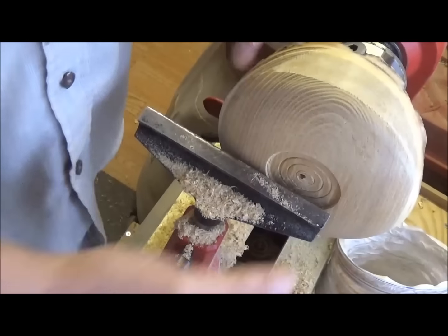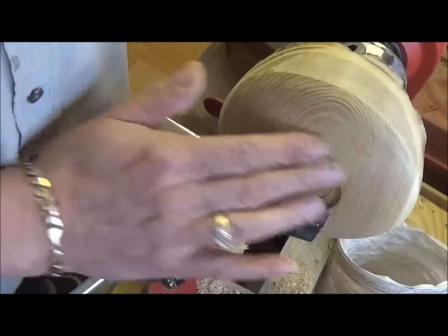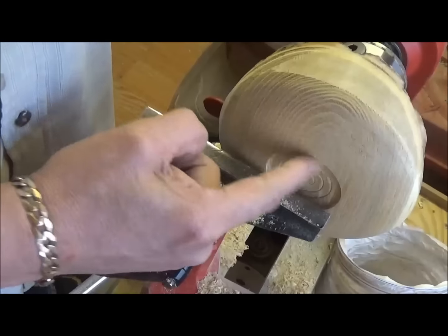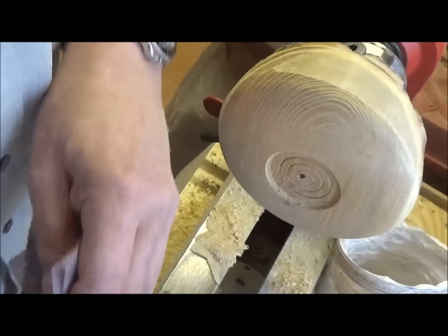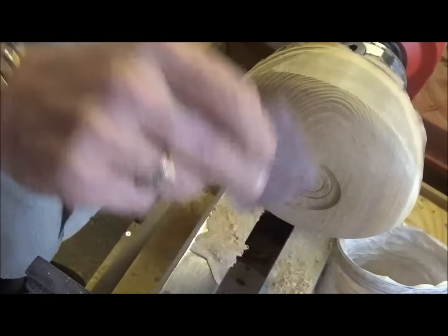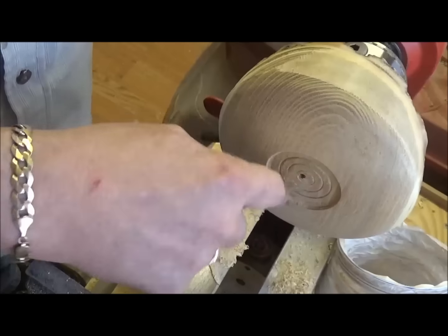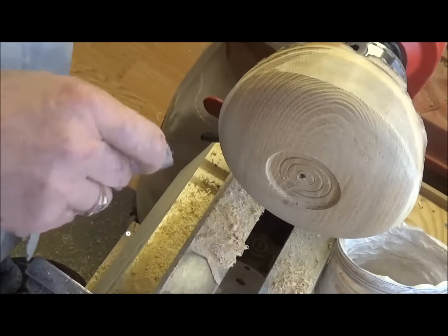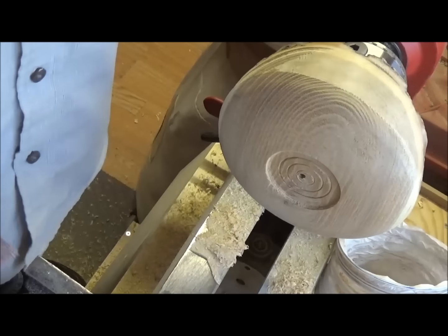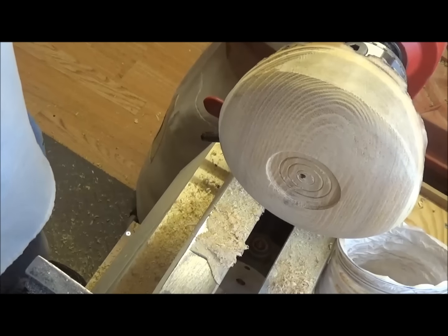Right, so I've got a bit of shape on the bottom now. I'm not going to go too far up, I can do that when I turn it round. I'm just going to go through the sanding procedure of getting the base done now, and then a bit of sanding sealant and polish. Again, can't stress enough, don't miss a grit. Be patient with it. You should get a decent finish. Anyway, I won't bore you with all the sanding procedure because it does take quite a while. So I'll see you later on when I've got it changed over, swap round in the jig, in the chuck.